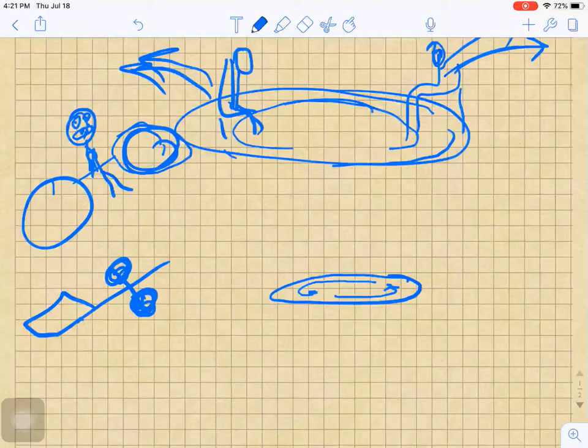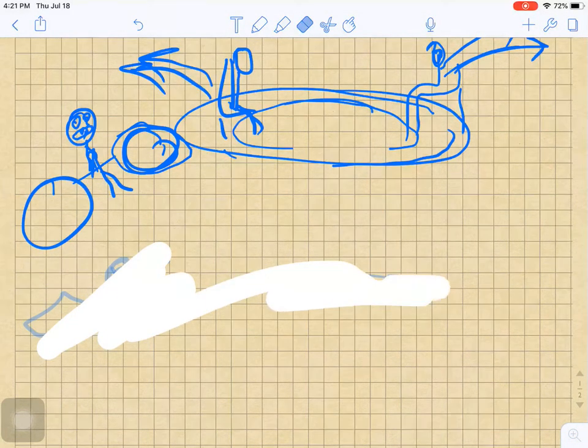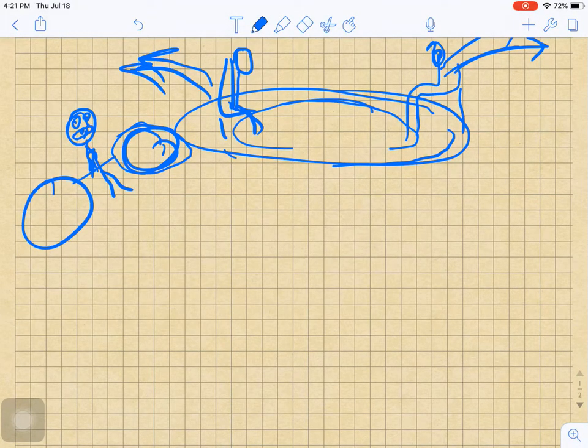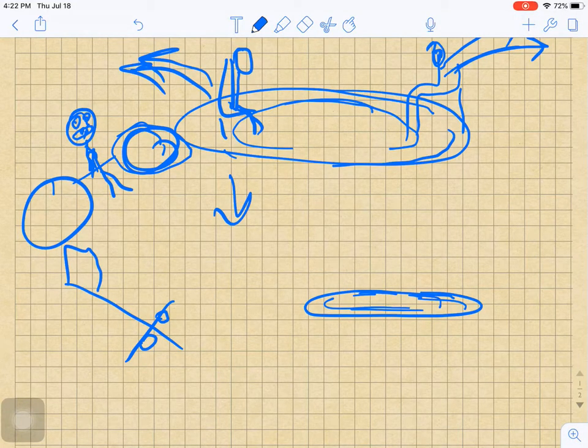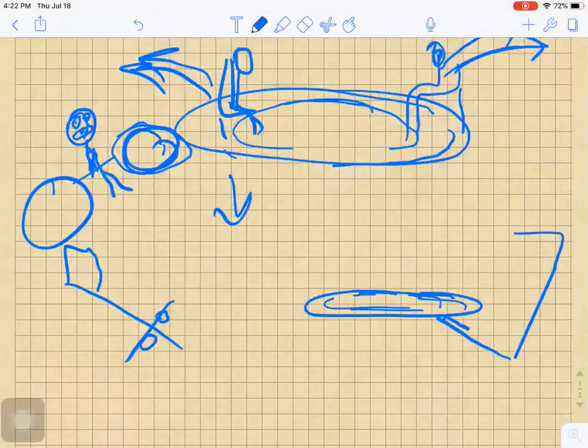You know what? Let me make it so you guys can understand better. Let's talk about this same theory coming down. Let's say your Seminole is going downhill, descending really rapidly. What happens to that disk is the RPM is supposed to increase, right? So as the RPM increases, this disk spins a lot faster. What happens to those flyweights? Basically, they go outward, right? They go outward.